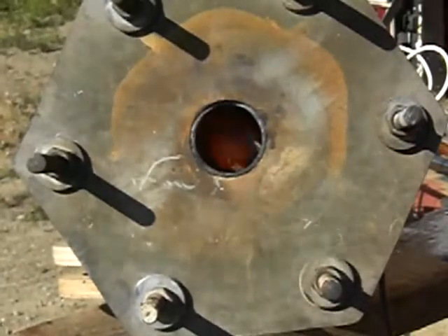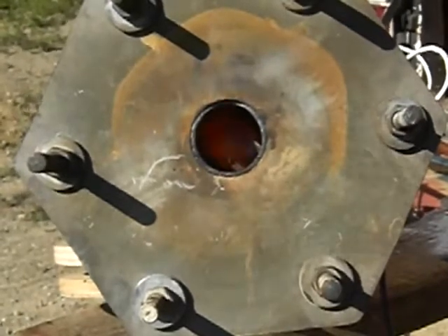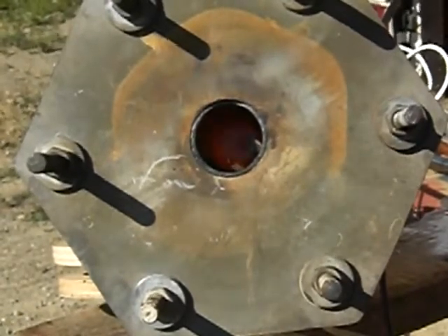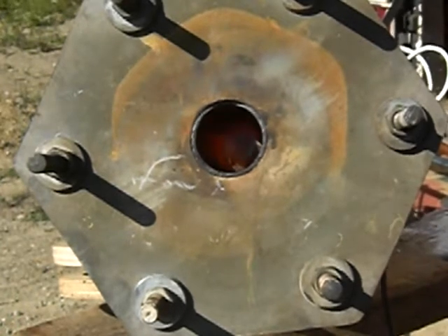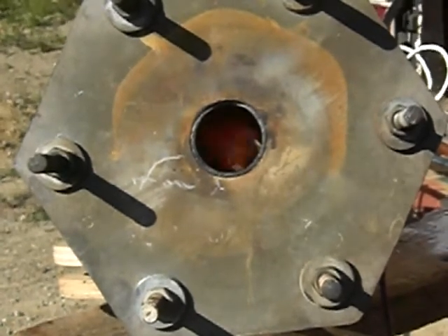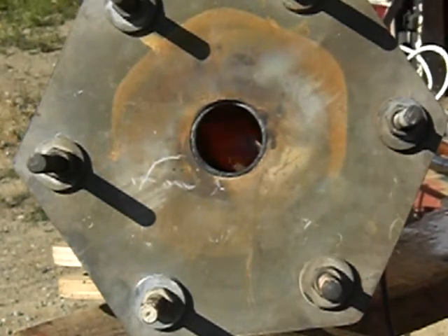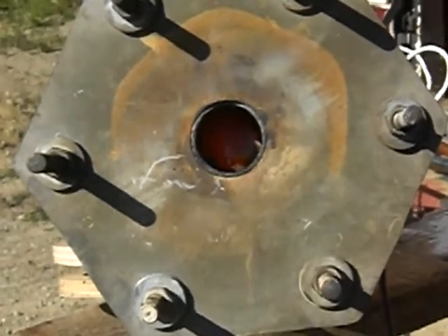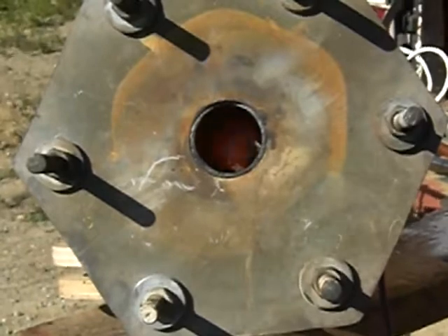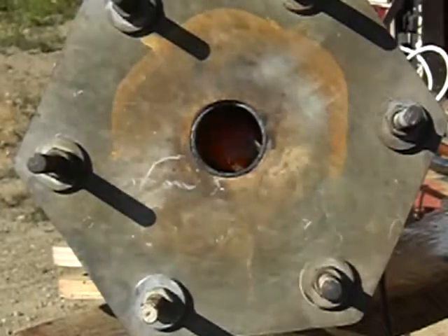Oh, look at that. That's nice. Nice, bright, smooth. Level 4. Coming out of the eye of the blue. The blue is actually forming like a ring, a brighter edge. That could be because of the output pipe though. That's where the propane and the air are immediately mixing actually. I would say this is a plus test.